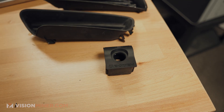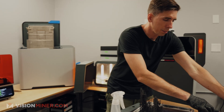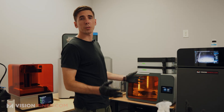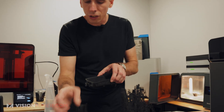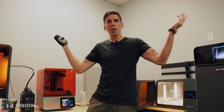Stay tuned for the Carrera GT mod projects, along with some really cool automotive content — we're scanning the entire suspension of a vehicle and a RAM air intake. Let's throw these right into the curing oven. I've got it on the black V5 profile, which uses no heating, since black resin can be over-cured. About five minutes and the parts will be ready. The curing finished — these are cured and ready to be post-processed and finished however they decide.